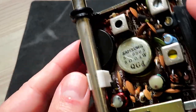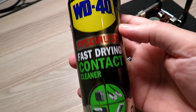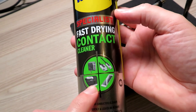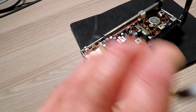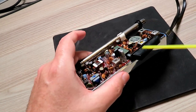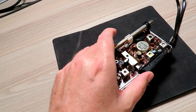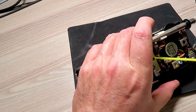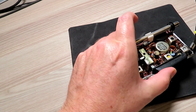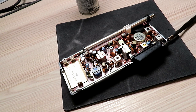A metal body front and metal body rear. This particular switch had a little bit of an issue. This is the contact cleaner I use — a lot of people use Servisol, but I've always used this. One thing to note with all of these cleaners: try and avoid getting it on any of the plastics, as on a matte black case it can actually mark and stain the decorative finish.